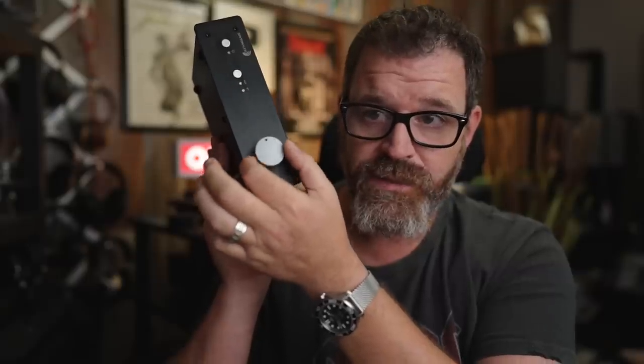However, the Dayton Audio just couldn't handle it. It started to get distortion almost immediately, and even when I turned down the volume, it still kept that distortion. And as far as the volume goes, when I'm turning this, there can be pretty significant jumps. This is a stepped volume, which means there are little tiny detents that you can feel when you're turning it up and down. I didn't feel like it was really consistent. Sometimes when I do it once, there wouldn't be hardly any change in volume, and if I do it another time, there'd be a big jump up. So it was a little bit more difficult to level match with the V3.